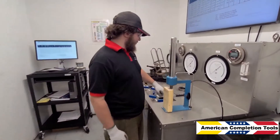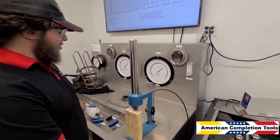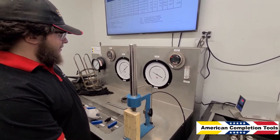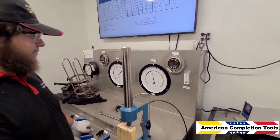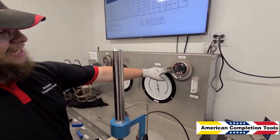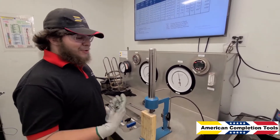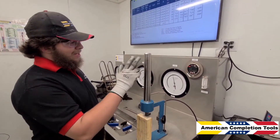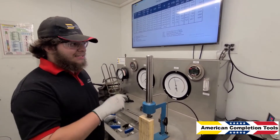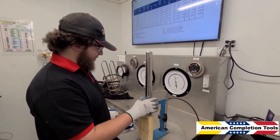So now I will close the valve, turn on our gauge, and then slowly apply pressure to the valve. We will test the open pressure and continue to fill the isolator. We will bring the test rack open pressure down to 50 pounds above our ideal test rack open, which would be approximately 825.